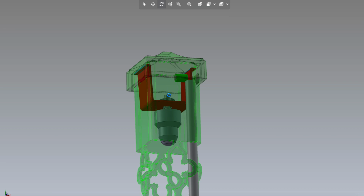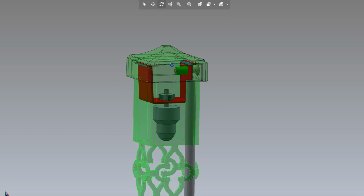So we've eliminated a few failure points with getting rid of the G4 socket. Everything's integrated now. You'll have a connection point here from the SPT1 to your lead wire from your LED module. So if your LED module ever goes out from a surge or just needs to be replaced with something higher, we have 4 watt options as well with this that you can easily just replace.